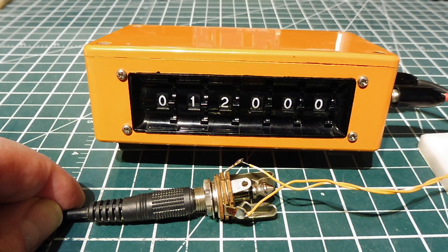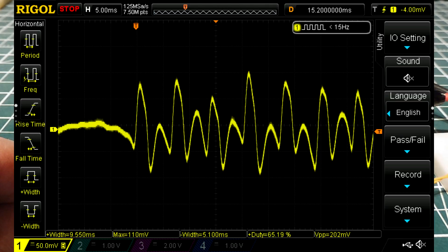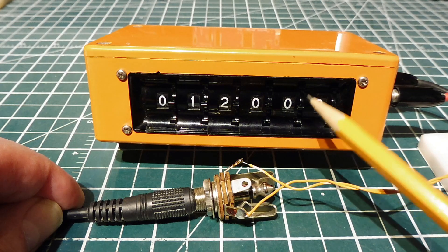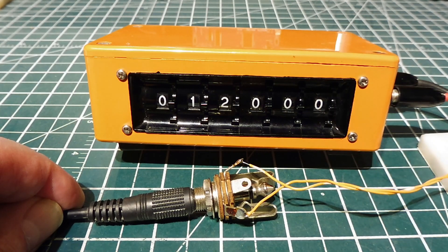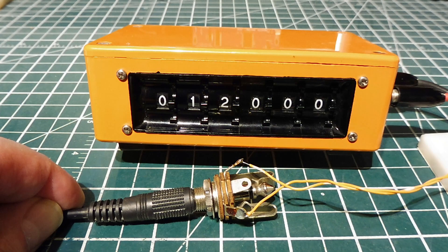Here's my setup to measure the output impedance of the guitar. The cable from the guitar is plugged into a jack connected to my scope, and I have a 10x probe so I'm not loading down the guitar. I take an open circuit reading — you can see on the scope it's 200 millivolts. Instead of a pot, I have a decade box placed across the output, and I turn the thumbwheels decreasing resistance until I get half the signal — 100 millivolts. On my decade box I got 12k. So the output impedance of the guitar is around 12k, though it varies with frequency and pickup. We'll ballpark it at 12k, so we'll need 120k ohm input impedance on our amplifier.